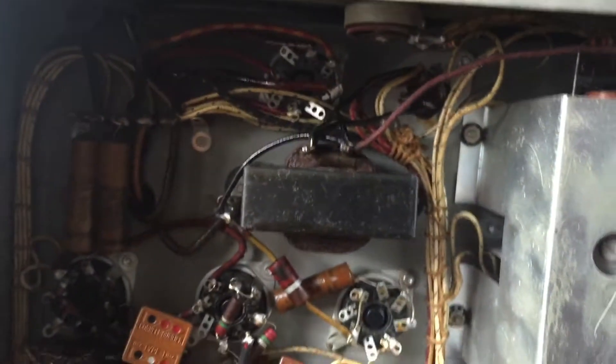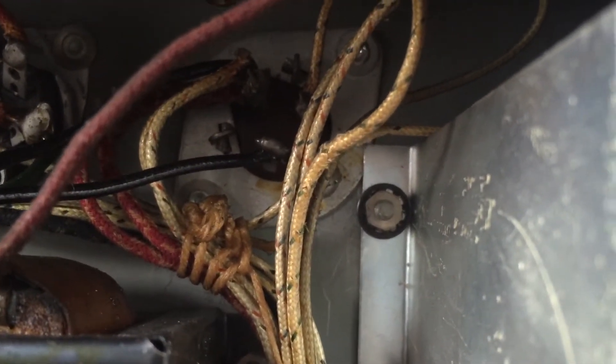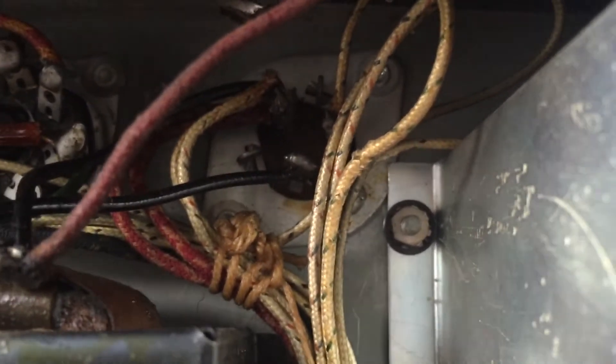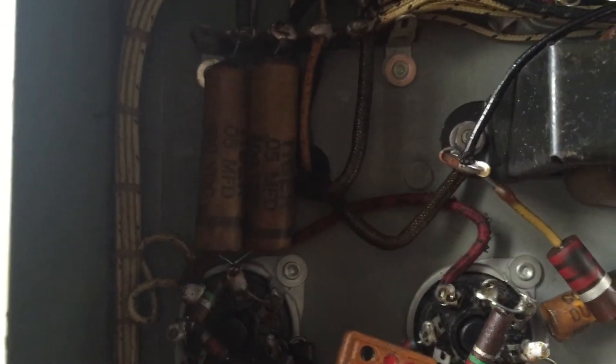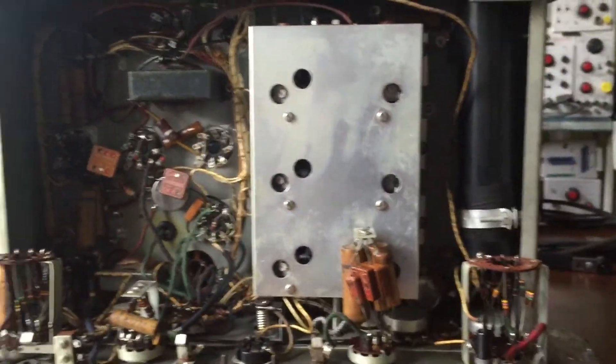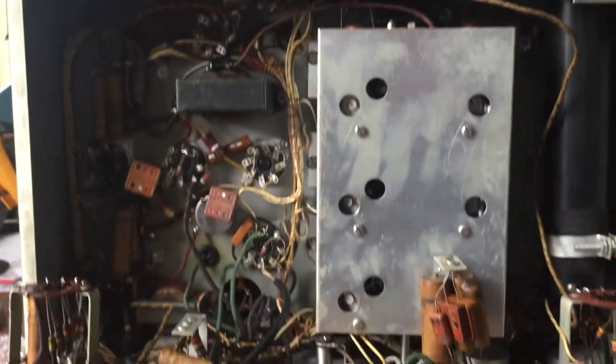The rest of this is pretty much what you'd expect to see in an instrument of this era. The power supply is pretty straightforward. First thing we're gonna do is desolder those connections to that capacitor and see if we can check it and possibly reform it. If not, we'll have to restuff it. These caps are just gonna be bad — I can guarantee you they're crap. I think it's really up to me to decide whether or not I want to go in and start a restoration or just keep this thing as a beautiful object, which it certainly is.